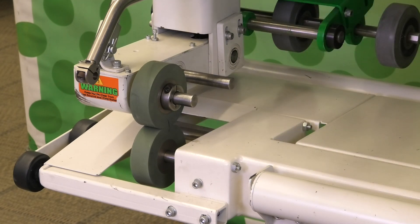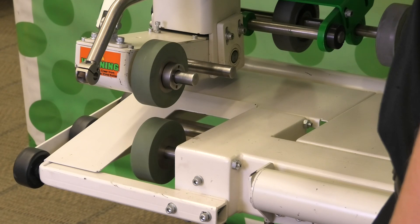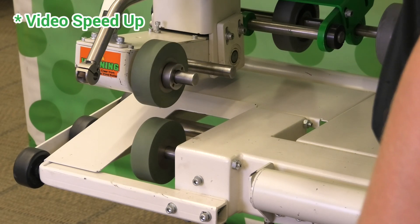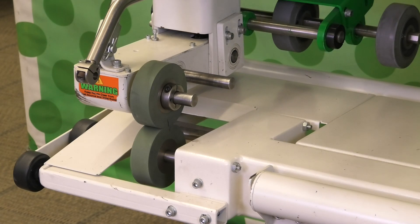Re-check their position by opening the rollers, letting them spin for 10 revolutions, and check again. Close the rollers — you'll see we are a lot closer to being lined up this time. We're about perfect after 10 revolutions.